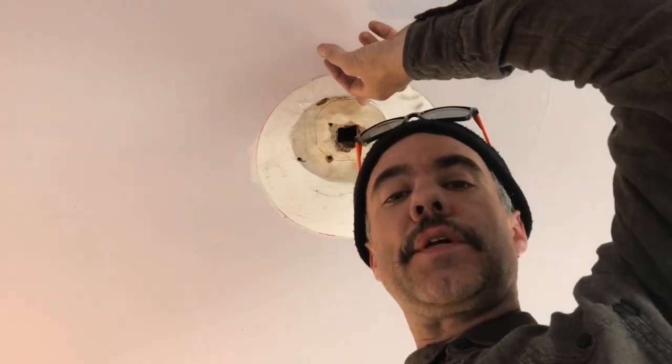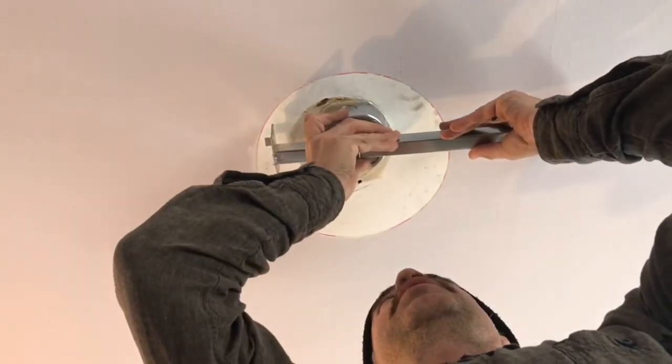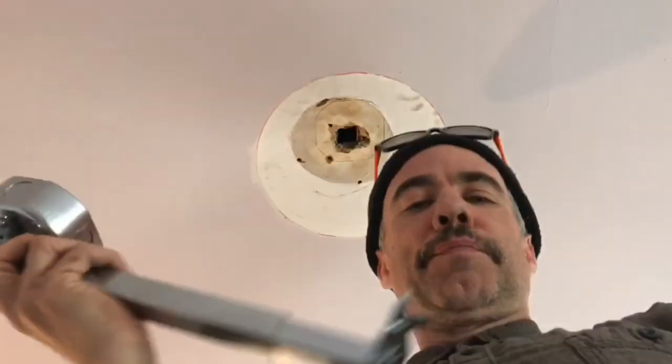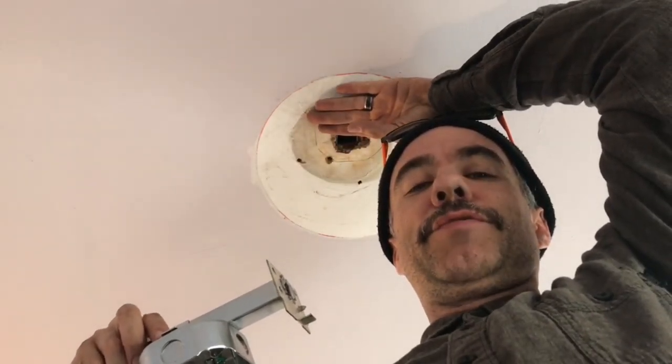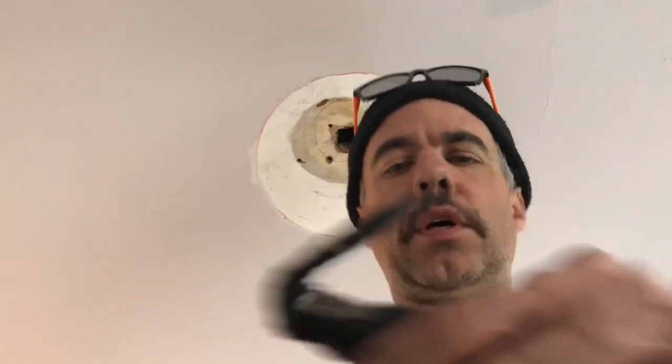What you're seeing now is the spot where I'm going to be cutting into the plaster and putting the ceiling fan box. All you want to do is take the box, put it where you want the hole, and trace it. The idea is that this box will come down and be flush with the plaster or sheetrock. If you have sheetrock, you're much luckier — I hate plaster. I'll use a small Leatherman saw to get it started, then a regular size saw to cut the rest.